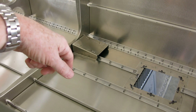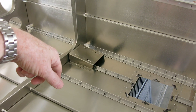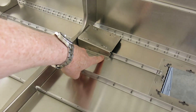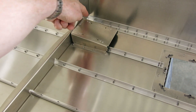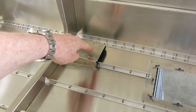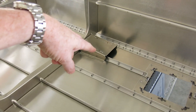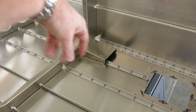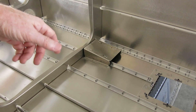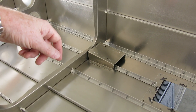I posted up to the group to see if anybody else had come across this and what they're doing. My initial thought is we're going to have to drill all these rivets out from here, and the ones on the other side too. We'll have to drill out these eight rivets, remove those nut plates, order stainless steel nut plates, replace them, and then put the whole thing back in. But we'll see what we get — we're just kind of taking it as it goes today.